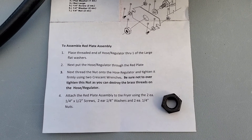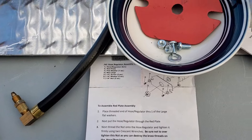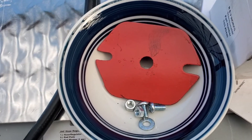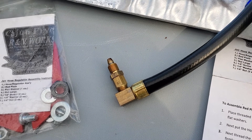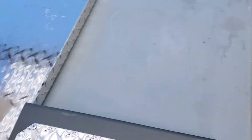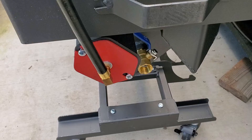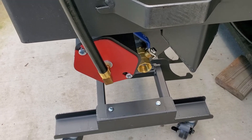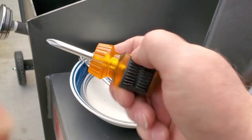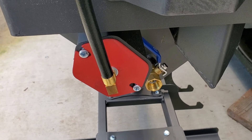The next step is going to be hooking up the regulator hose for the propane. This is the kit it comes with. It looks like that red plate and that end — I'm going to put a washer nut on it, assemble that first, and then attach it to the side of the unit — that is where our gas goes, and it's on each side of this unit. I've got those installed on both sides — used 11mm metric for the back side and a small handheld Phillips, and got those tight. That does it for the propane.